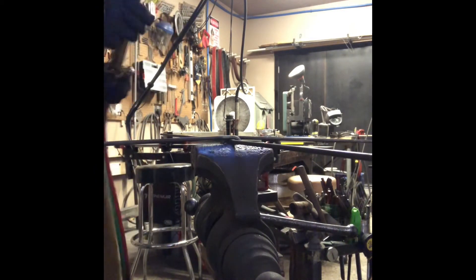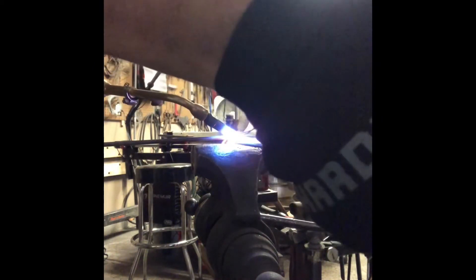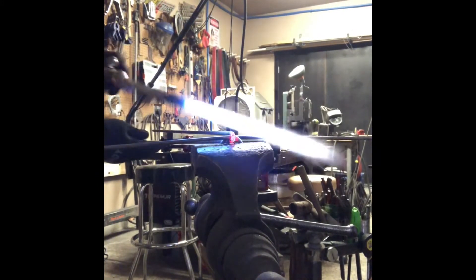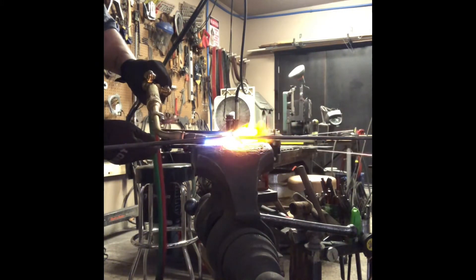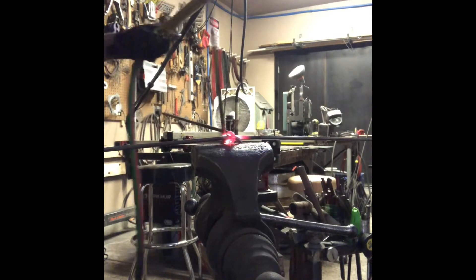The braid — here I'm using the gas saver to heat up the straight bar I just passed through the ring. We're going to fold one end over 180 degrees to the other side, then fold the other end back 180 degrees toward the camera, and fold the other two ends the same way across 180 degrees. Then we just alternate, doing the folds that way as we build a stack, which you'll see develop here shortly in a time-lapse.